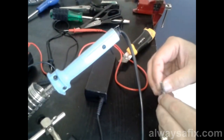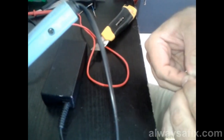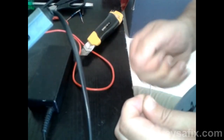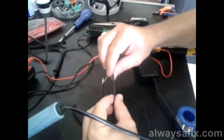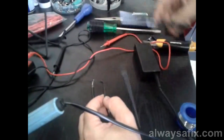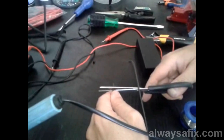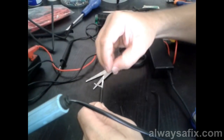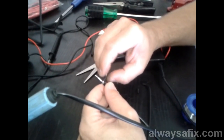The outside cable — the mesh cable — that's your negative. The inside is your positive. We've also got some thinner heat shrink tubing which we're going to use to help isolate the individual pins.